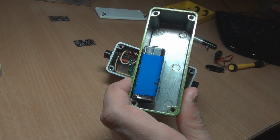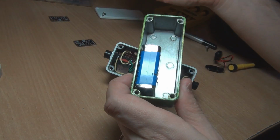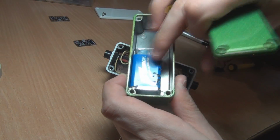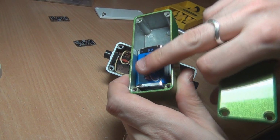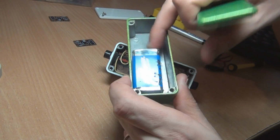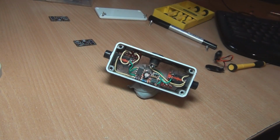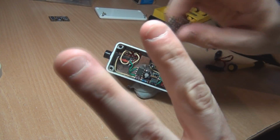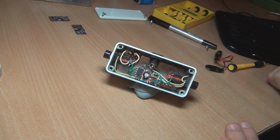But oh yeah, does the lid fit? That's the real question. Well, the lid will fit when it's like that. So you can do it standing up, or you can do it lying down. Whatever works. I think you'd actually want to have it standing up, because you're not going to be able to put anything across the top of it, because there's just not enough room. So you'd probably want to stand it up, put it off to the side like that. But anyways, just some food for thought. If you're going to build a punch amp or build one of my Chime amps in a 1590A, if you're planning it, it might help.